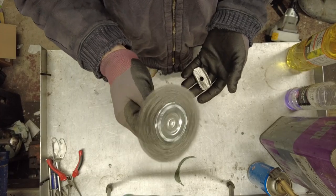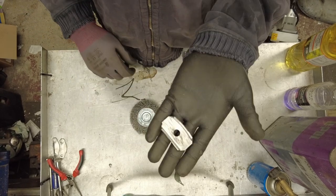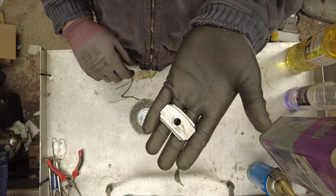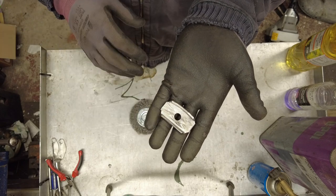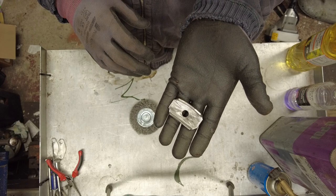The first thing you want to do is get your wire brush — or however you're going to clean things — on your drill. Make sure it's super, super clean. It needs to go back to bare metal, so there can't be any oxides, any rust, or any paint on there. The oil has to penetrate the surface and get to all of it. If it's not completely clean, it won't cover evenly or it may start to flake off.